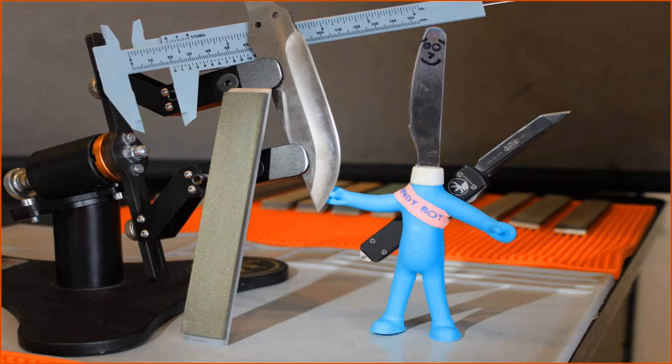If the angle doesn't match up on both sides, this causes a major problem. Your bevel will not be even. Specifically, one side of the blade will be wider than the other. Your edge will look horrible, and everyone will laugh at you and tell you how much you suck. Later in the video, we will use the calipers as a second means to prevent this from occurring. After you gain experience, you will not use the calipers very much.